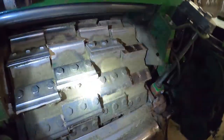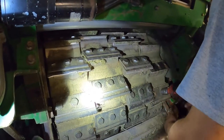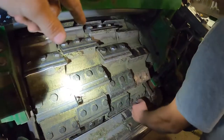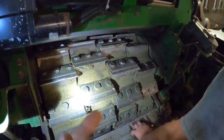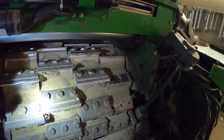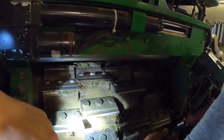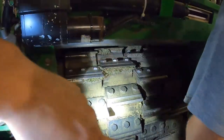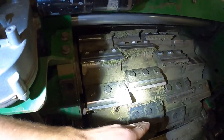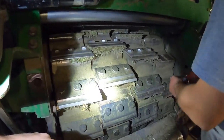When we're tearing this apart and pulling the knives out, you don't just pull them straight across like this because it free-spins and it'll throw the weight balance off. Because it's balanced, you pull off one whole roll - or column, however you want to label it - and then do the next one. That way the weight stays balanced, because otherwise we've had it where you'll take some off, get like a quarter way done, and then all of a sudden it'll just flip on you.